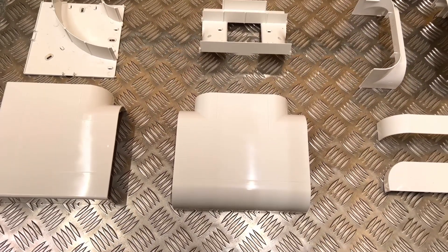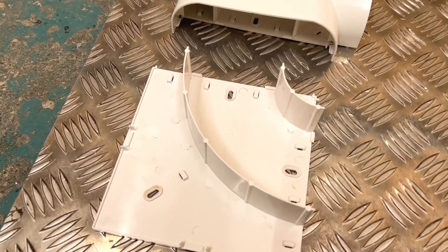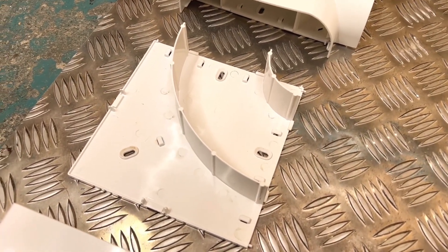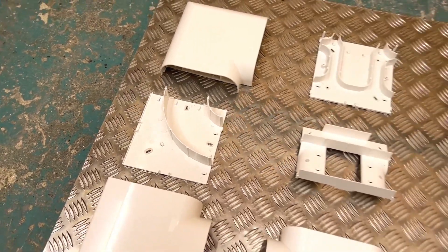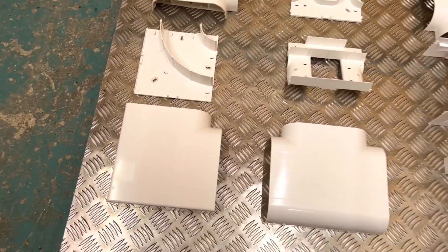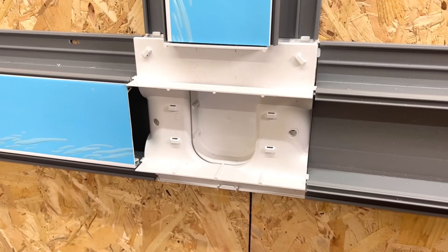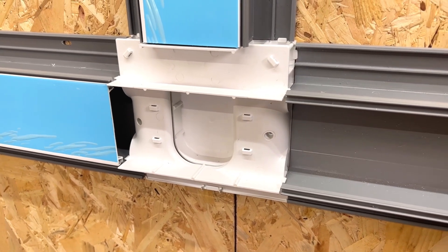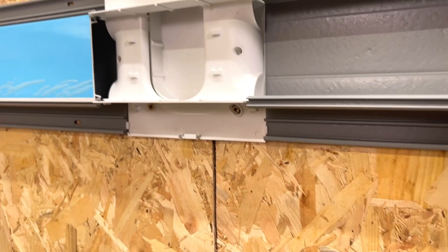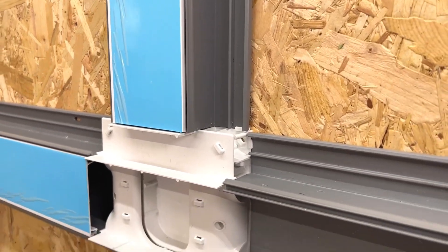These are great because they provide continuity for the three different compartments of trunking and even allow you to maintain the required bending radii for data and mains cables. If that segregation of different cable types isn't required, you can get a variation of these fittings that simply act as lids that snap directly onto the trunking, saving a bit of installation time. I'm particularly a big fan of this T fitting because it allows every single compartment of every single piece of trunking that it joins together to access every other compartment while still maintaining that segregation.